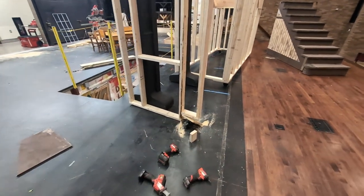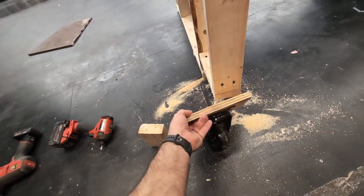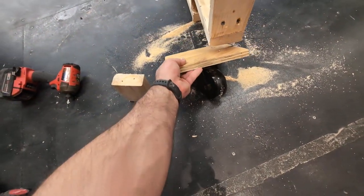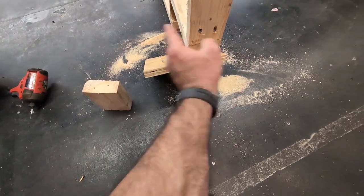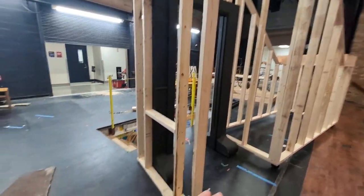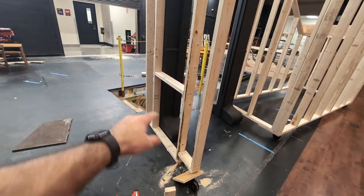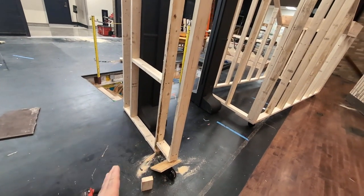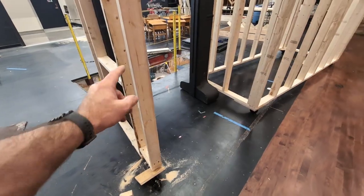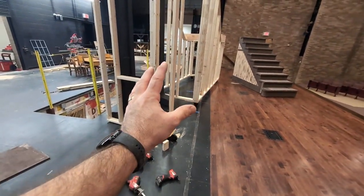And the last part of this is that, like I said, this plywood wasn't attached, but the load center of this wheel is in the middle of that circle base. And that ends up outside the footprint of this load bearing situation. And so this wheel out here will always be trying to tip up. Once I get that plate on there and the plywood there with the wheel on it, I'll probably end up taking an angled gusset at a sharp angle and going up to the wall on both corners of that plywood to truly brace it all in, up there.